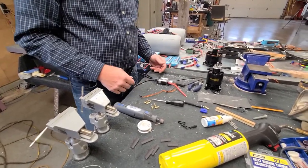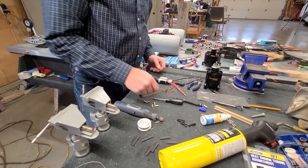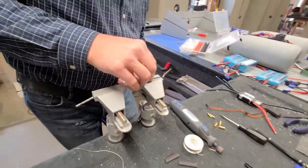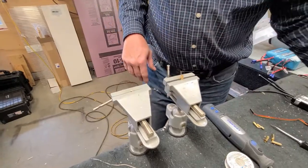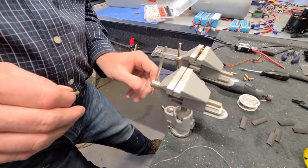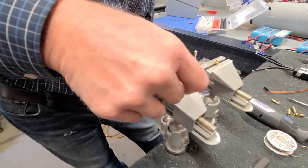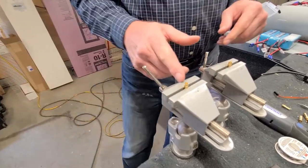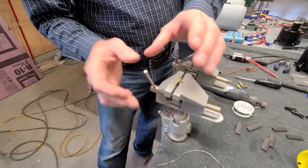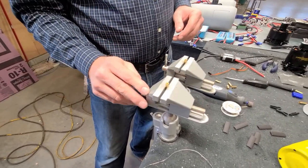Yep. And to show some soldering technique here that may help you do it more efficiently. I'm going to take these handy vices that Rod got me at Harbor Freight. They have a little tiny V right there on that one jaw, and that is so handy for this type of application. Some connectors will be cut away half of it. You can tip these vices all around so that it's all laying there like a trough. It's really quite handy.